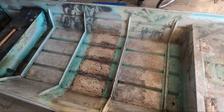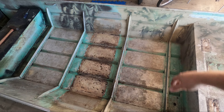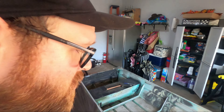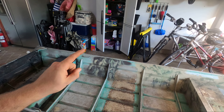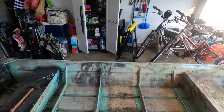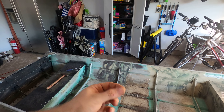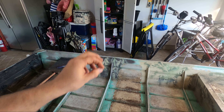It seems to be more of an issue on the bottoms than the sides. If you're getting stuck punching rivets back out after cutting the head off, shave it again with the screwdriver so it's flush and it'll pop right out. Final thoughts — this was a lot more work than I expected, so don't go into this thinking it'll be a quick job. You are going to be hammering and punching — it's going to take a minute. Just be patient, it's a process, but if you follow the process it does work. Final tip: flattest screwdriver you can find, flush with the metal.